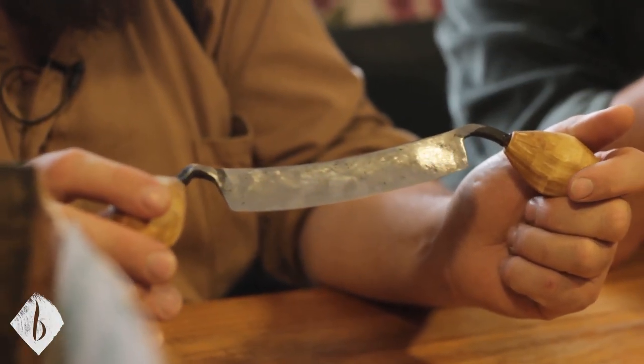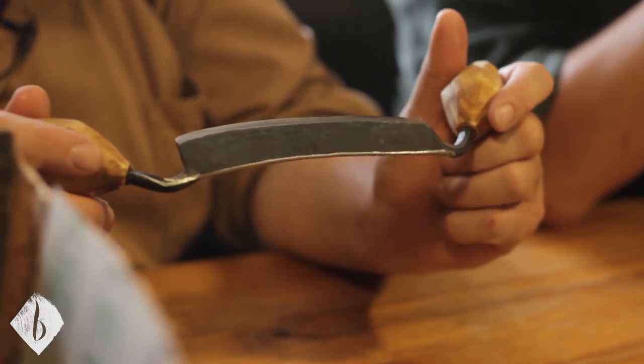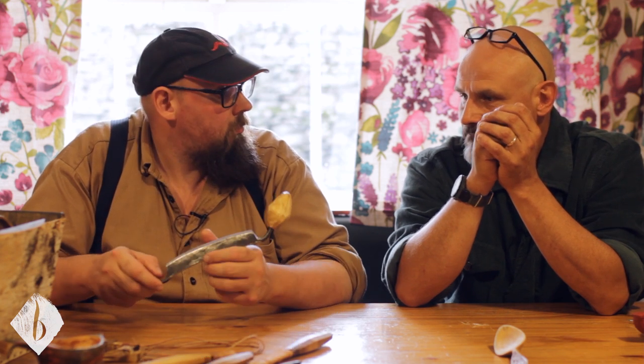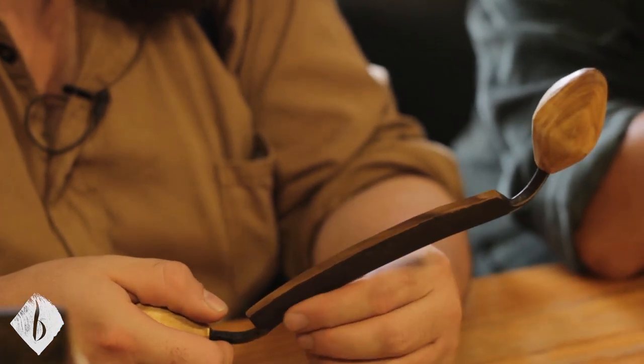Okay, so what steel do you use for this? In the beginning, I was into recycling 100%. I took spring coils from cars. But the quality turned out to be various. Some knives snapped, though I thought I made a proper heat treatment. So nowadays I buy a carbon steel. It contains 0.8% carbon, and I have a diagram with the correct tempering and annealing.